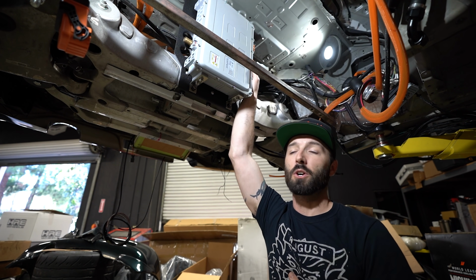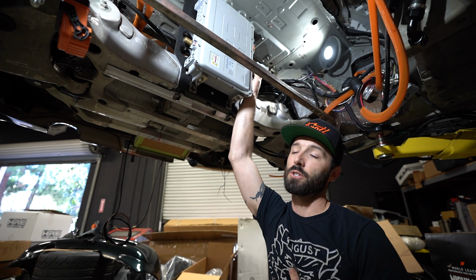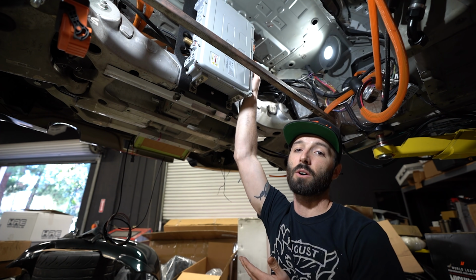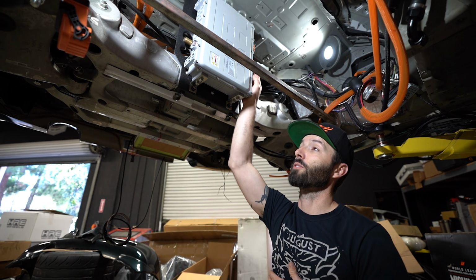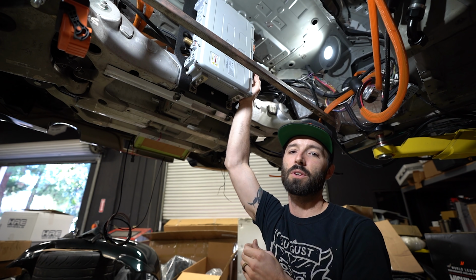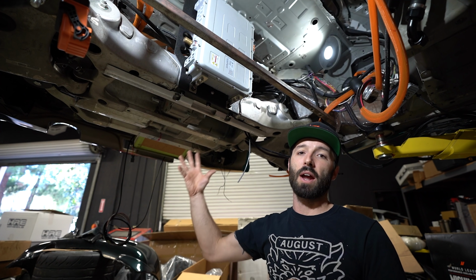Now this is one form of charging. There's also what's called quick charge. The kind that we're going to be using is called CHAdeMO, and that connector is going to be mounted at a later date in the rear of the car. It's going to take direct 400 volts at a higher amperage, and it's just going to cram 400 volts into this pack.